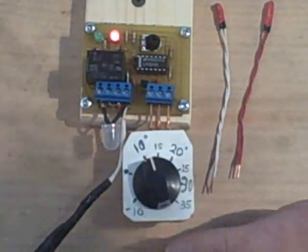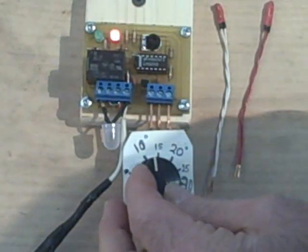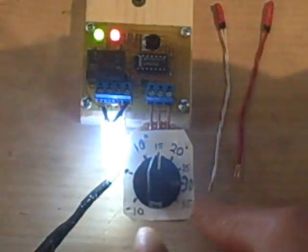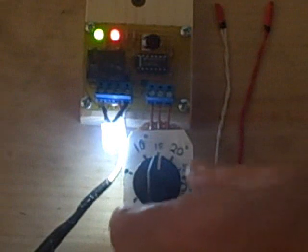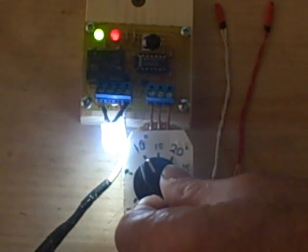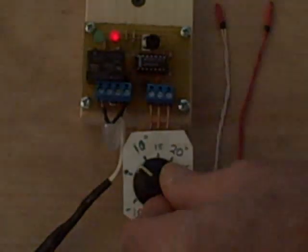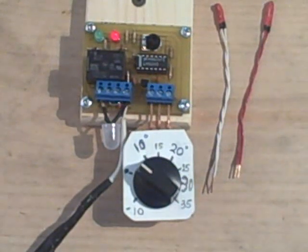You can see right now we're up to about 11 degrees, 12, 13, 14, 15. At just about 15 degrees the pump comes on. Then turning it back down — at just about 5 degrees the pump comes off. This is a pretty good setting.